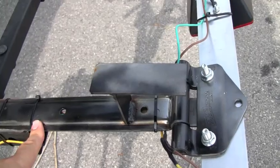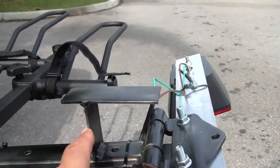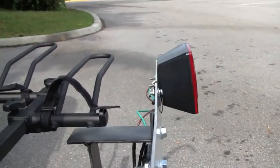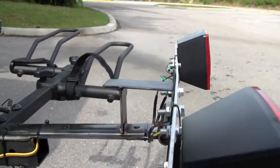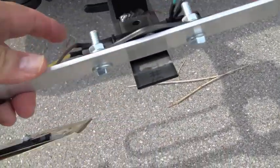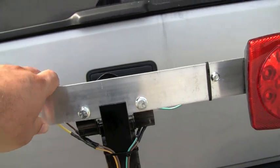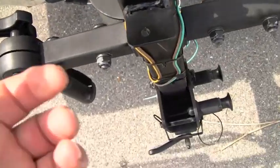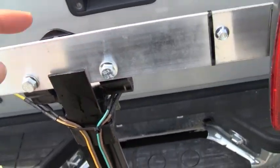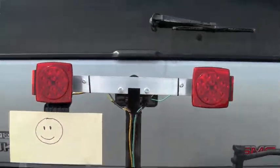Basically this is a hinge from a trailer — a door hinge to a trailer. I had this L-shape with a little lip welded here to prevent this from going back too far, so it stops right there and can only do 90 degrees. I had a flat bar welded here so it can't go too far up — 90 degrees exactly. And I had a square piece welded over here with a hole for a quick-release hang point.